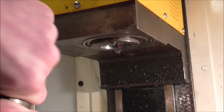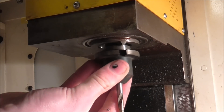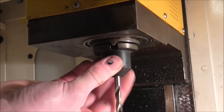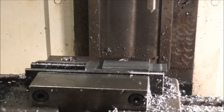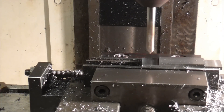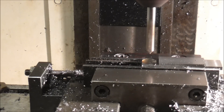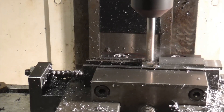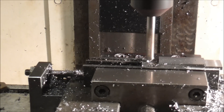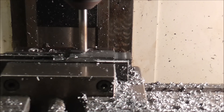We have to align a tang with a little slot — I'm not sure if it's called a tang actually — but that's in now, so that's tool changing, couldn't be simpler. I'm bringing our spot drill in here, we'll make a drop of oil. A spot drill is basically a 90-degree drill if you like, and then it's just a straightforward drilling cycle.